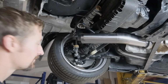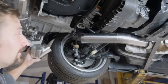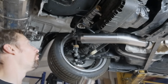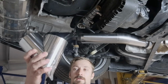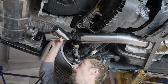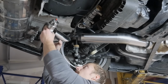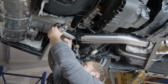It's easy from now, kinda, other than this is the critical bit, because we've got to connect it up. It's obviously got to land exactly where that V-band is that we fitted on the back box, and we've got to get the valve portion bang on out under the tailpipes. So what I'm planning on doing is making a Y piece like this, and I'm going to install that something like this. Probably with the valve the other way around. Yeah, the valve will go like this. I'm thinking in real time. So the valve will go like that, and then that'll shoot off towards the back box.